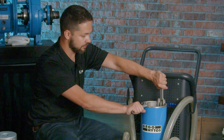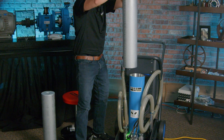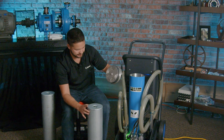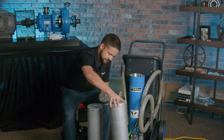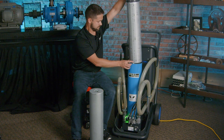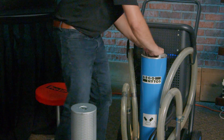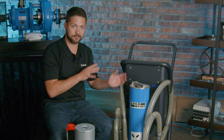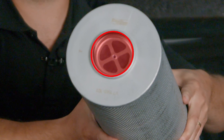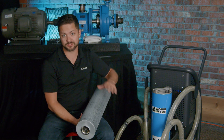Back to the filter element itself — it's not too hard to loosen it off, take it out, and then you can swap in another filter element. As you'll see, that's a pretty easy process to get the filter out and get it back in. When you look at the bottom, you'll see the filter rating, and there's also a backflow valve right here. So any dirty oil or contaminants that might be within, when you take the element out to replace it, they don't go back into the housing. That's an important feature.